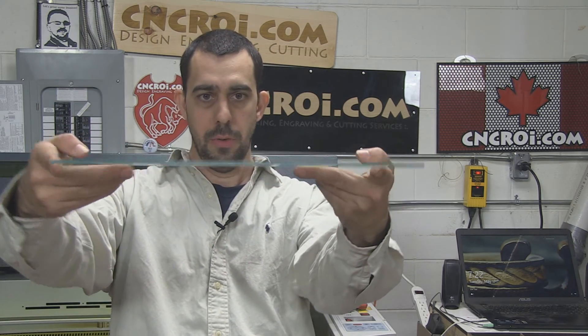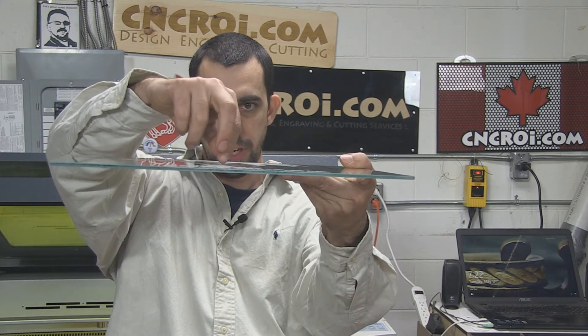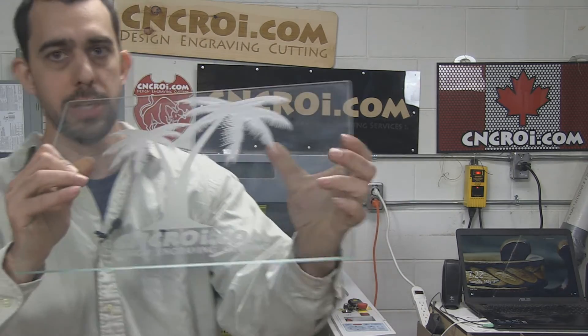And now you know how this was made. There are some distinctive differences between how a sandblaster works versus a laser. You have a flat surface here. What the laser is is an inverted cone — it just warms up the very top surface of the glass, shattering it. That's how you get the frostiness.